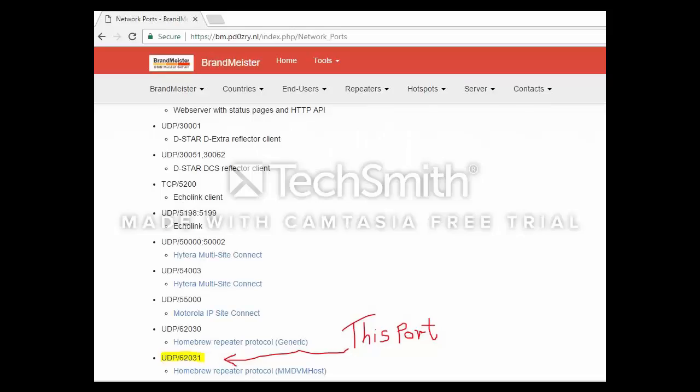A quick note on port forwarding: you'll need to forward your cable modem's ports so that when you talk with the Raspberry Pi to the desired network, specific ports on TCP/IP need to be opened and forwarded back to your device. If you don't have that set up, then you will get no response, and you'll also have trouble maintaining the connection. So set a static IP address on your Pi if I was you, and look into port forwarding and/or a demilitarized zone for the device.